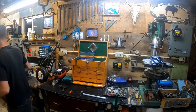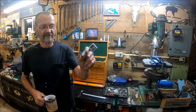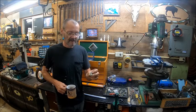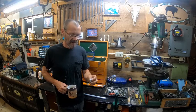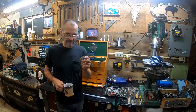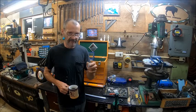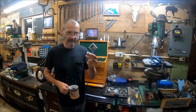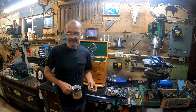And we'll end up with that much left. That can be turned into one, but I haven't made a jig yet for it. I need to make a jig out of steel that is smaller than this, that has a male thread on it of 6mm — I think it's 6mm by 1.0 thread. So these can be turned into one, but I have to make the adapter so I can screw it onto the lathe, turn the O-ring grooves, and then I can make one out of the last piece.